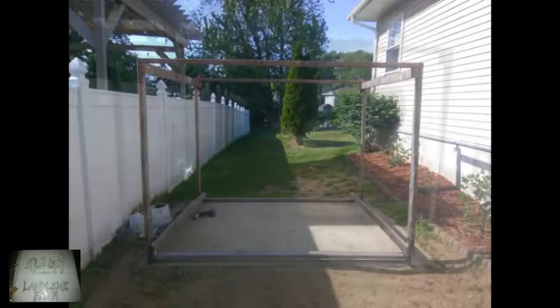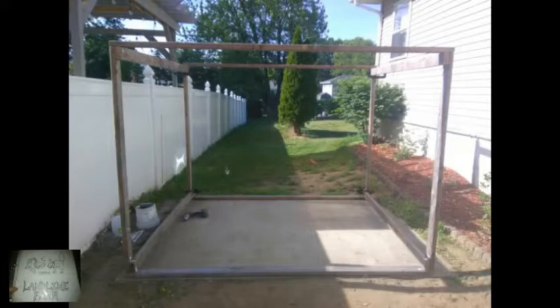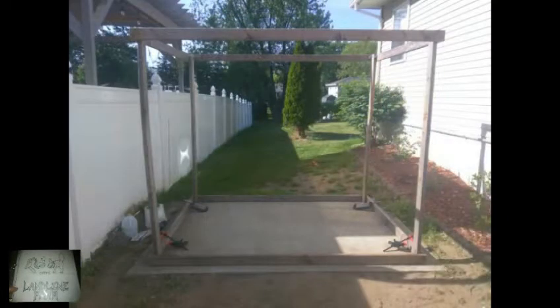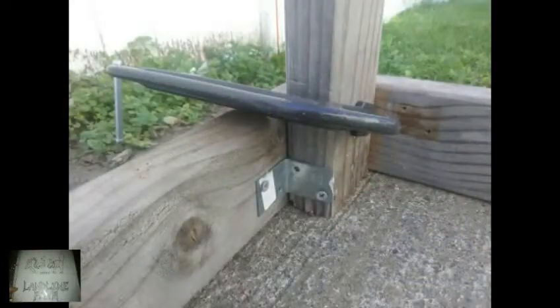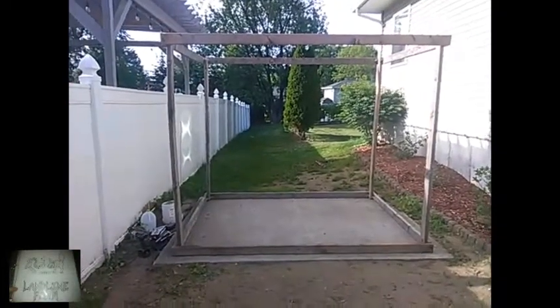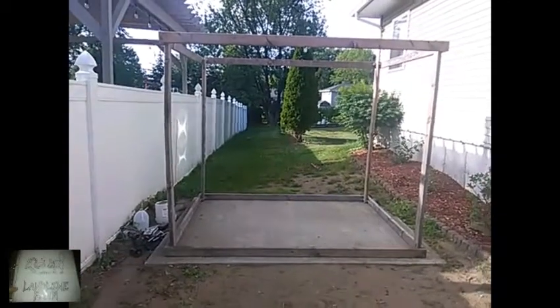Tip the edges up. Clamp Y pieces on. 2 screws each bracket into top plate only. Use clamps to squeeze wood together, and then make sure all 4 screws per plate are finished before tipping. All clamps facing in on bottom plate. And in place, remove all clamps. Y pieces and bottom plate surfaces must touch ground. Clamp and screw. Cube before: 8 foot X. Mobile unit after: about 7 foot Y, 6 foot Z.